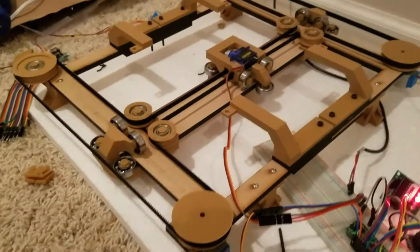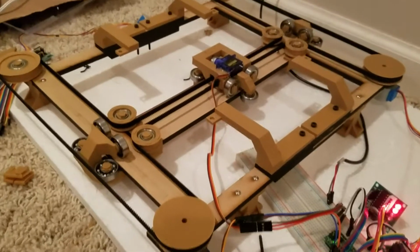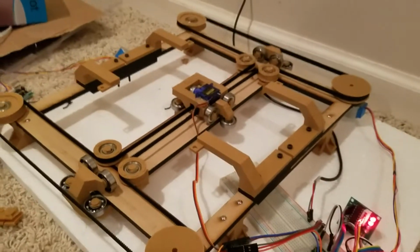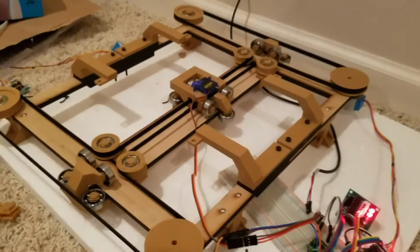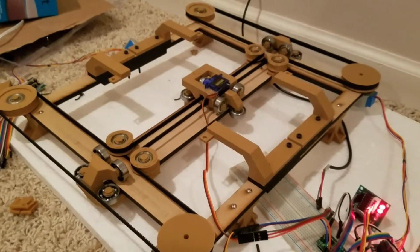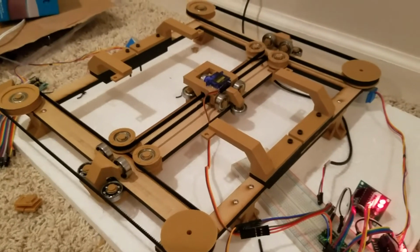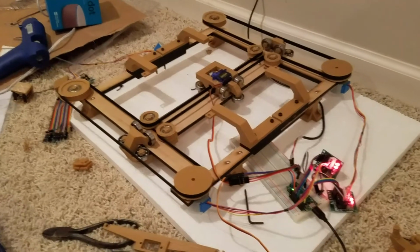Yeah, I don't know. Laser cutters are difficult. That's been the primary challenge here. I can only cut for about 20 minutes at a time, twice a day, because the laser tube gets really hot and then needs to cool down. I got a Craigslist mini fridge and drilled some holes in the side of it in order to try to make this process better of cooling my water for it, but it only does so much. There's a reason that the professional ones cost thousands and thousands of dollars. Anyway.